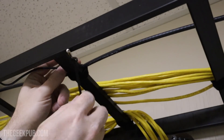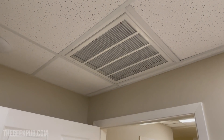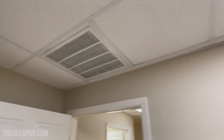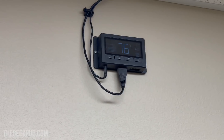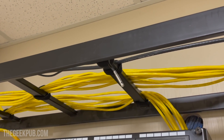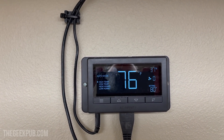So we have our return — this is where air gets sucked in by the AC Infinity and sent to the air conditioning's return. We have the controller for the AC Infinity, which gives it instructions based on room temperature. And we have a temperature sensor that detects the room temperature. It's 76 degrees in the server room right now and we have the setting to come on at 80, so the fan is off. I think this is going to work out really well — this should keep the server room at 80 degrees or less at all times.